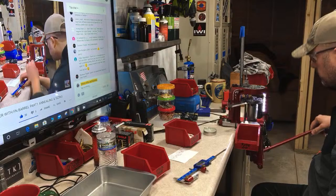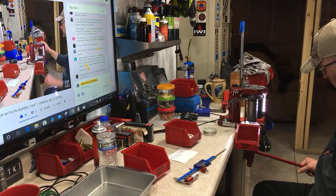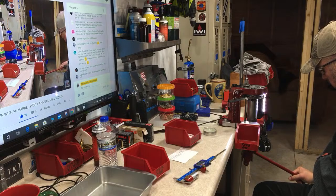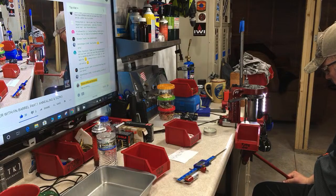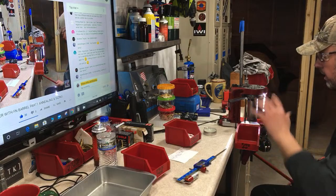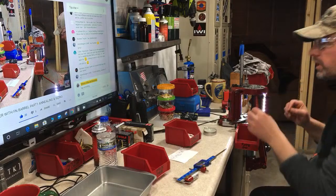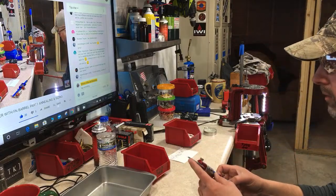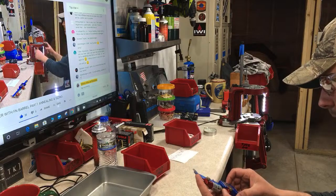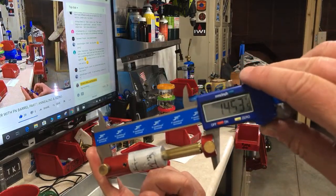So it's slowly going down. I start to hit the overcam. I'm going through the overcam, slowly going through the overcam, and bottoms out. Don't press down on it. I'm gonna let it sit there and back this off. You let it sit at the bottom for a little bit. Sometimes you don't have to run it through twice. Because remember, this is stubborn Lake City brass. It's not fired out of my firearm's chamber. So 4, 5, 3.